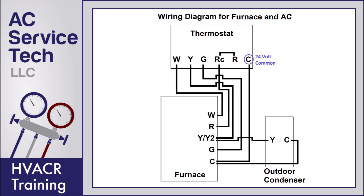You're going to notice that C is wired, so you are hard-powering the thermostat in this wiring diagram. You can wire the system up with only four wires instead of five wires shown here if you have batteries in the thermostat — then you don't have to wire up that C terminal.